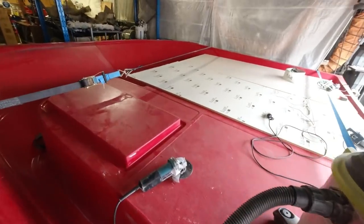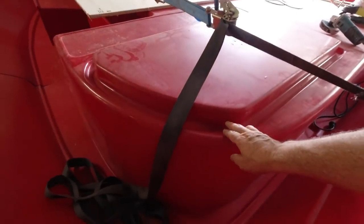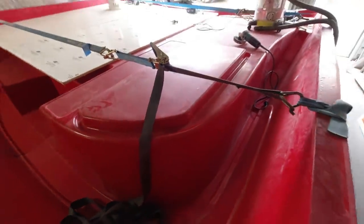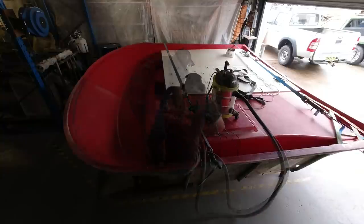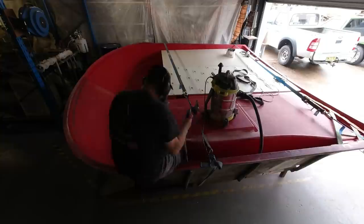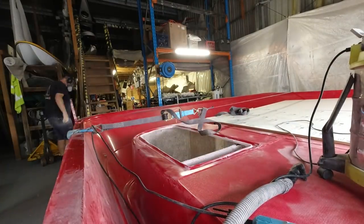As much as I don't want to, I need to remove this to enable me to continue flat along this whole cockpit roof. This is actually sitting up about 8 or so centimetres so I need to get down to this level here - I'm going to have to grind this out. What this is is actually the entrance to the flybridge - it's where the staircase comes up and there's actually a polycarbonate door there. So it's got to be cut out in any case. I'll keep the piece - whoever buys the mould off me can simply tuck it back on, plasticine it and reuse it. I'm going to cut that out now and then I'll be able to continue on with these flat sheets all the way over and get it finalised.